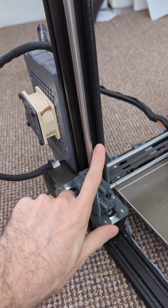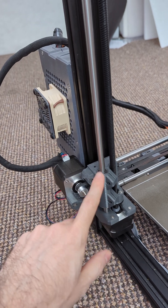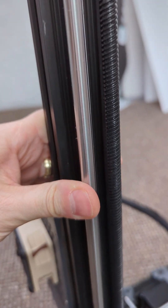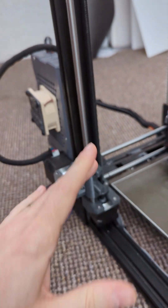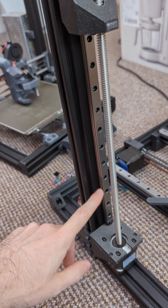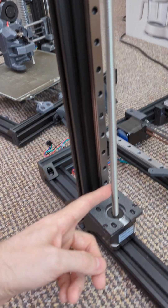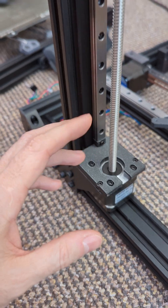This 3D printer has a lead screw and a rod for the Z axis, and if they don't align perfectly, the rod is slightly flexible and so is the lead screw, so they kind of mostly work. But when you want to have a linear rail, which is much more rigid, alongside the lead screw, and the motor mount is 3D printed, there's a risk that they won't align correctly.